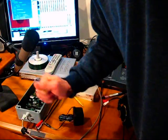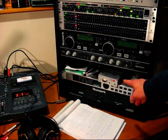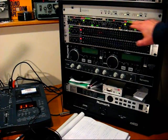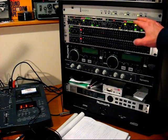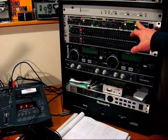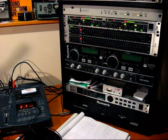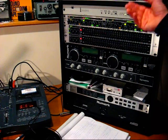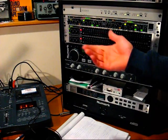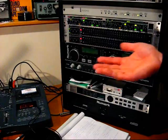Actually my remote transmitters go through this unit right here, which is the in streamer, the other end of this. This side of the compressor is going to my local transmitter. This side of the compressor, there are 2 separate halves. This side of the compressor is going to my distant stations, and it's also going to my live 365 feed. And then the local one ties into this modulation unit, the Inovonics, and it's shaping the AM waveform to give me a cleaner output, is what this unit is doing. Equalizer is pretty important. A lot of people with a computer system that's just going out of there, you can have equalization done inside the PC.